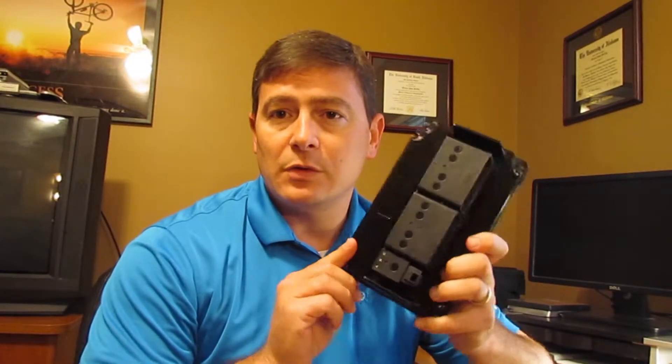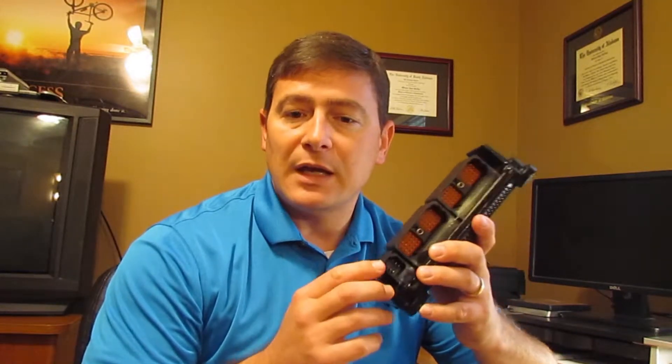Each unit is equipped with three CAN channels, one USB port, and depending on the unit, either 12, 20, 32, or 48 I/O. The I/O is highly configurable. I'll put data sheet links below so you can see individual unit specifications, but as a general rule, you have digital, analog, thermistor, and frequency inputs, and you've got current control PWM outputs, digital outputs, and also H-bridge capable outputs.